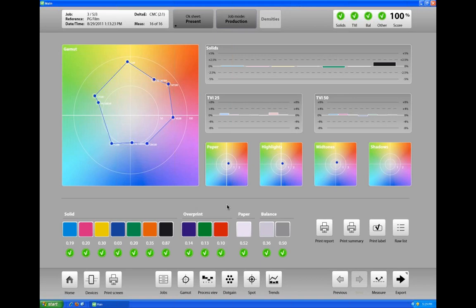In this illustration, you pretty much cannot see a white line underneath. That's because we're printing right on top of the targets. If there was a particular area where we were not hitting the amount of color we needed, we could see where the blue line was either exceeding or coming up short of where we needed to be.